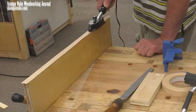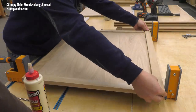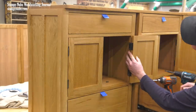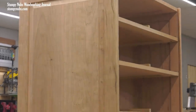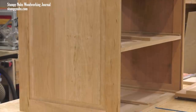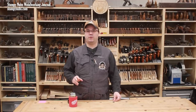Of course lightweight construction isn't always important, and with modern plywoods that aren't affected by humidity changes and movement, and which may be covered with ultra thin highly figured veneers, is frame and panel construction becoming obsolete? Well, plywood must be edge banded and not everyone likes the look of edge banding. Putting a plywood panel inside of a solid wood frame eliminates the need for edge banding and produces a more traditional look. Frames with flat panels, such as we created for that office furniture, are a trademark of early 20th century craftsman design. Frames with raised panels, such as we're creating for this Shaker cherry dresser, are common to many types of period furniture from the 19th century and earlier. You may not need a frame around your panel, but if you like traditional styles you may want one. As you can see, there are a lot of reasons to use frame and panel construction for casework as well as cabinet doors. The only question is what's right for your next project. See you next time.